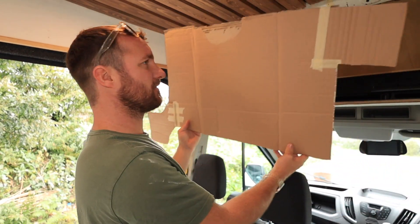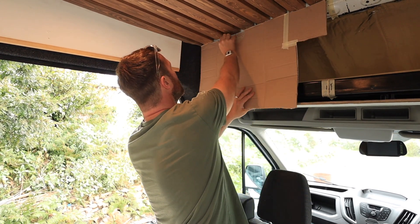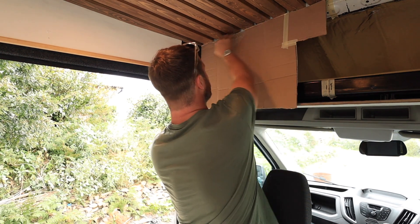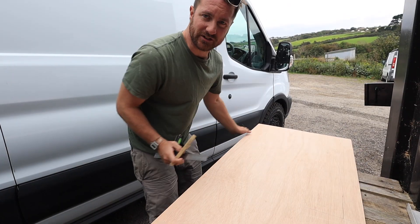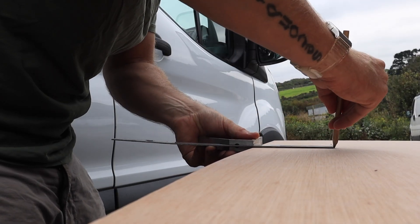One of the main things is I've made a really rough template just to get these curves right. When you build a front for this it's a lot easier to build your templates out of cardboard rather than holding up a piece of wood and scribing — you can stick bits on the end. The main lines I really need are that curve there and this part here as well, because once I've cut that I can then scribe the bottom one. I'm going to do this in two parts, same way as I did the bed front — do this side, put it up, and then make the other side so I can scribe both sides without too many problems.